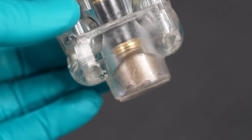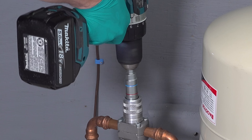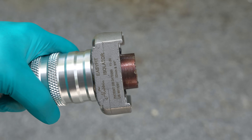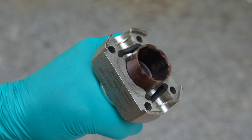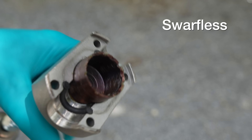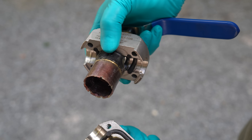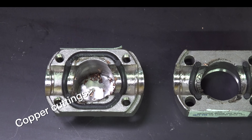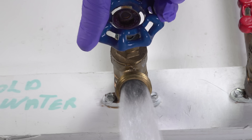If you didn't watch that first video — as you're drilling into the pipe it clearly is making some shavings of copper, and people wanted to know where do all those bits go. Are you going to clog up your dishwasher or other filters in your house? The cutter inside, which is made of stainless steel, is called a swarfless cutter. It is certainly cutting through the pipe but it is designed to produce a very minimal amount of shavings. It is still a good idea to flush out your lines when you're done with the job.